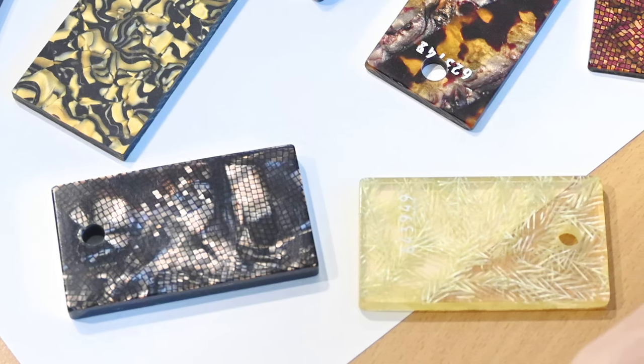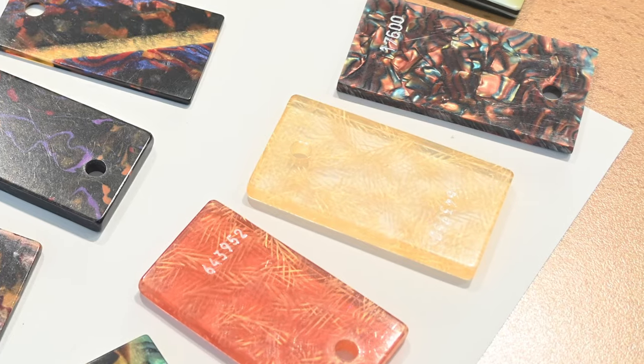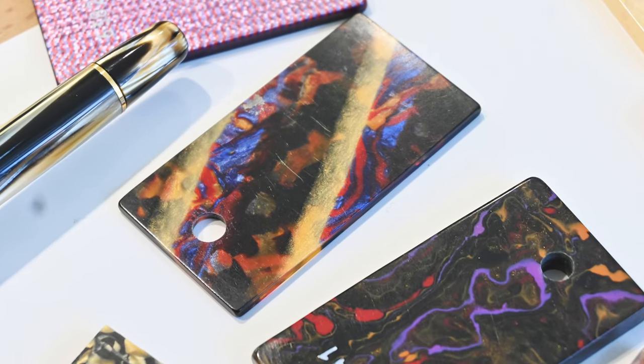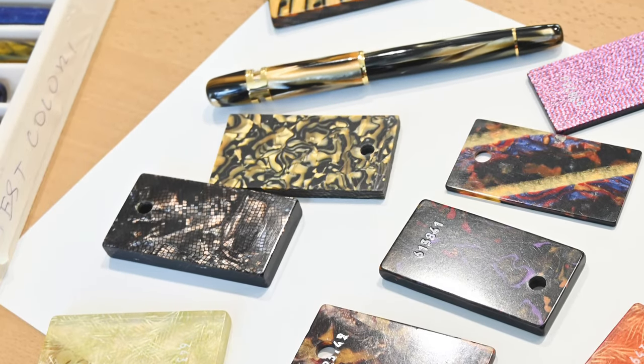Don't forget that one of the biggest problems on the other hand of celluloid was crystallization. With time, if some components are too high, and we don't know this because the material maker never tells you the exact components they put inside, they can cause crystallization of the celluloid.